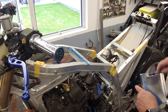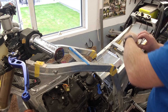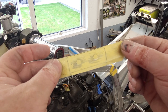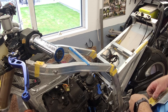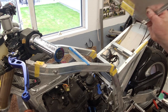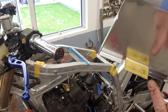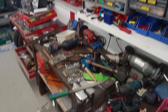Okay. So let me take off a piece of tape. You end up with this. So you can stick that onto your workpiece and transfer your datums. What we'll do now is center punch our two holes and drill it, and then we can mount it on the bike and we'll just work these two corners here. So it's just a simple little trick I was shown years ago by someone in my family that's sadly no longer with us.